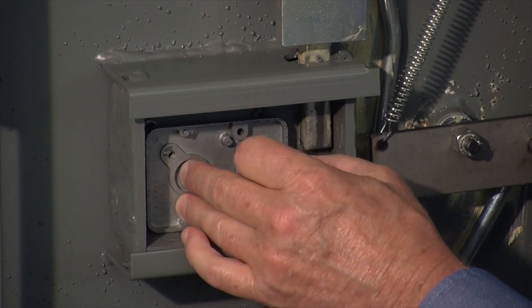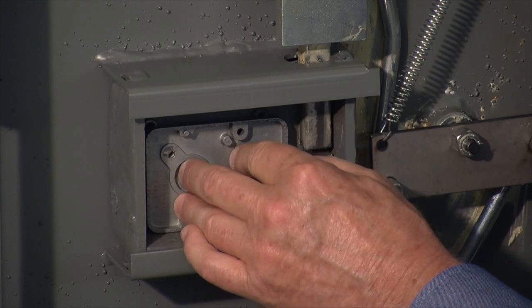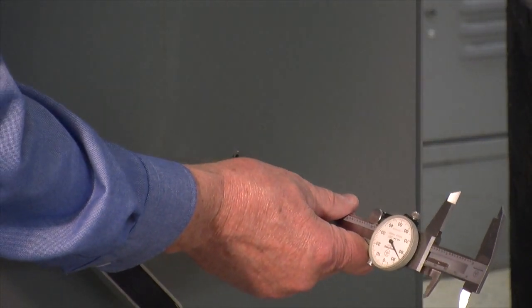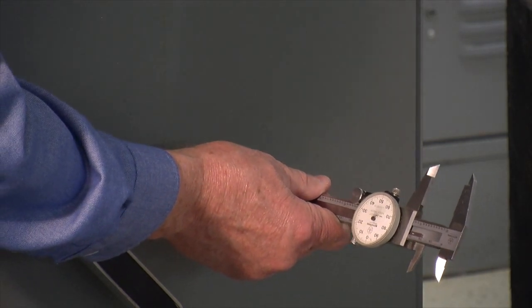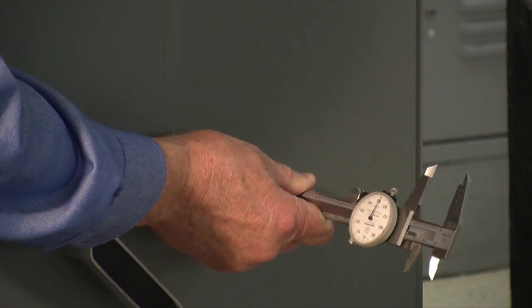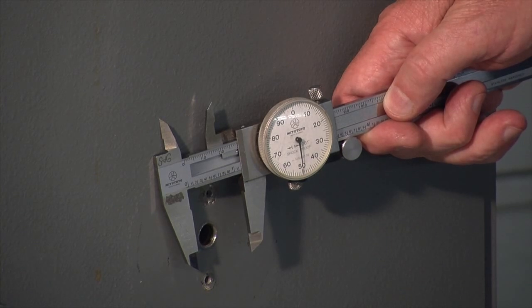This one feels pretty good. We'll also use this plate as a stop for the depth probe on a set of dial calipers to measure door thickness. Holding the flat metal plate against the mounting studs, I insert the depth probe from my dial calipers through the spindle hole and bring the base of the calipers right up against the front of the door surface. My door thickness is 1.150 inches, and we may use that measurement later when we size the dial spindle to length.